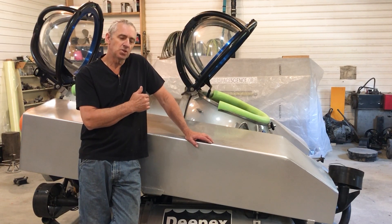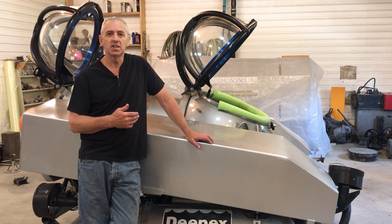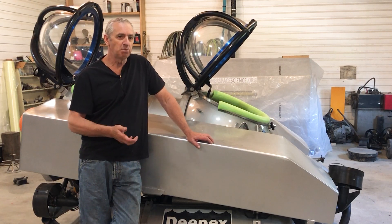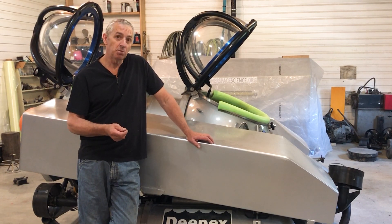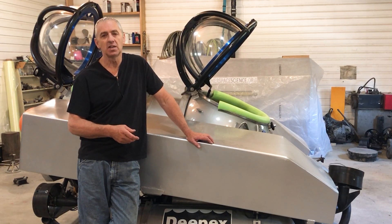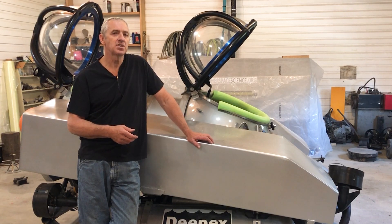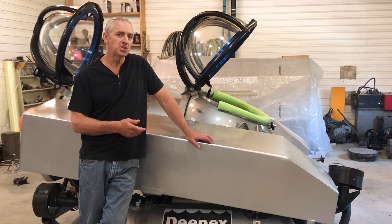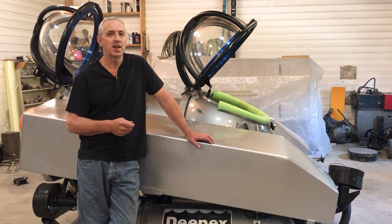The deep workers are built with a feature where they can be released from the chassis, but for some reason they didn't do that with this sub. So everything is in place for the chassis to be jettisoned — it just has to be activated. The problem is the high pressure air tank and the oxygen tank are connected to the chassis, so I have to do some reworking to remount those tanks so that when the occupant spheres are jettisoned, those tanks come with them.